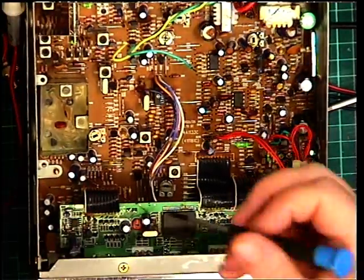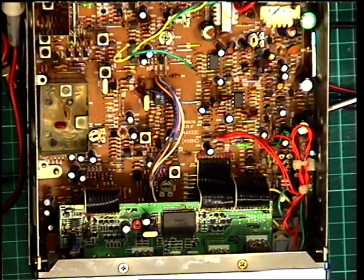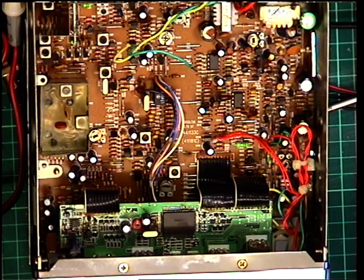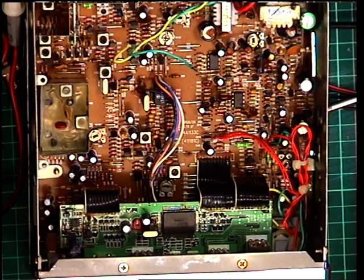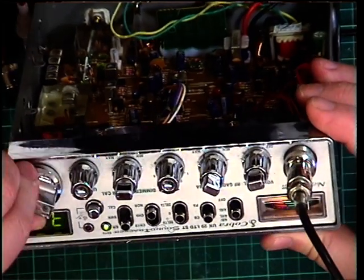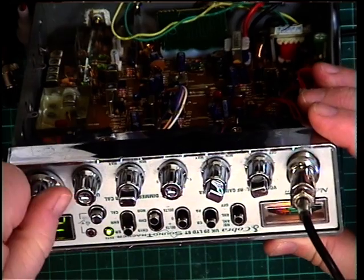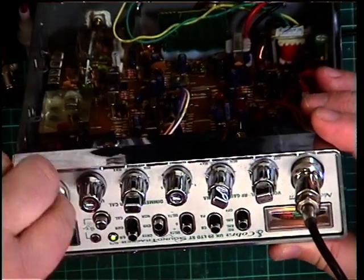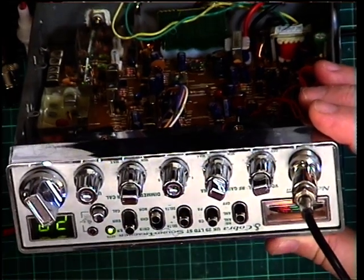The crystal trimmer for the frequency is going to be that red one down there. So I'm having to do it the daft way — we'll plug in the test set and power it up and see what power it's transmitting at the moment. All lit up. I'll select channel 20. I'm going to tune this up on UK, and I'll do the same with the customer's because he's told me he uses UK, not EU.